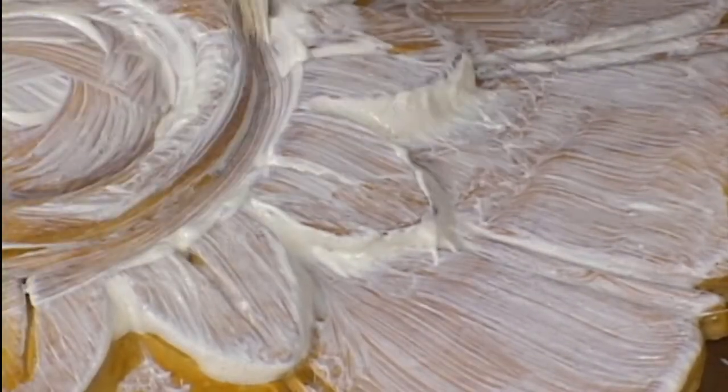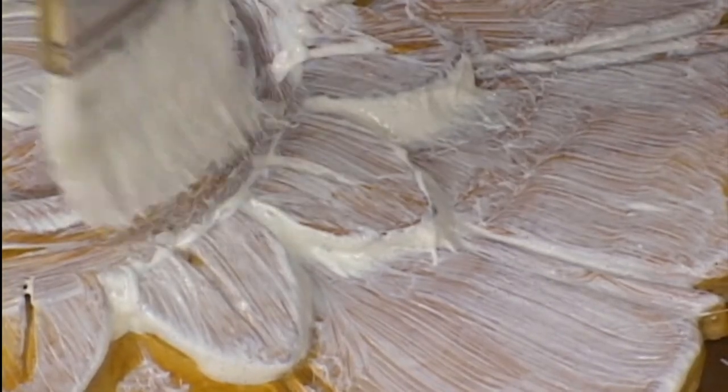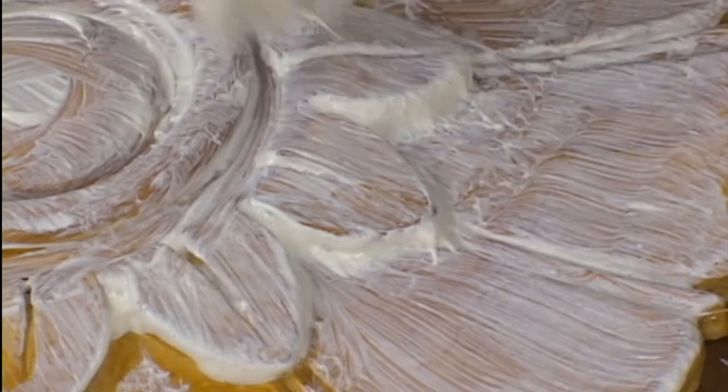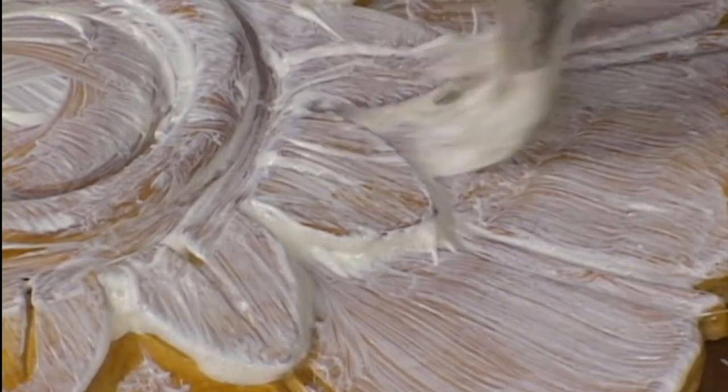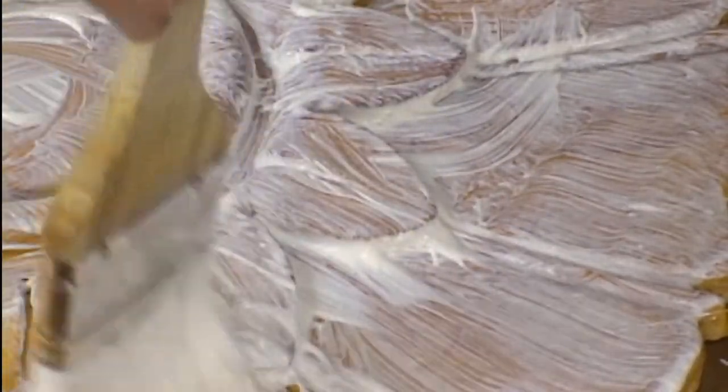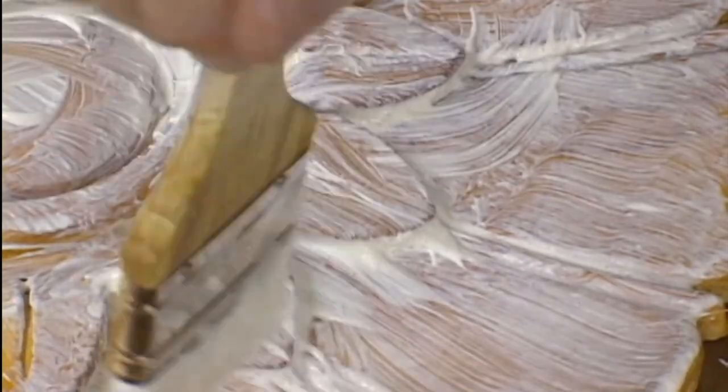Again, as you apply your first coat of latex to the model, make sure you eliminate any buildups of the latex in all the cracks and crevices on the model. You need to work this away and let it dry in a thin coat for the first coat so that it gives you a really good detailed surface of the model in your rubber mold.